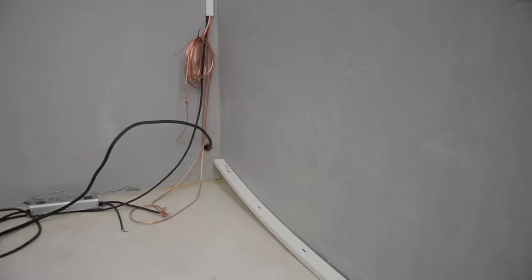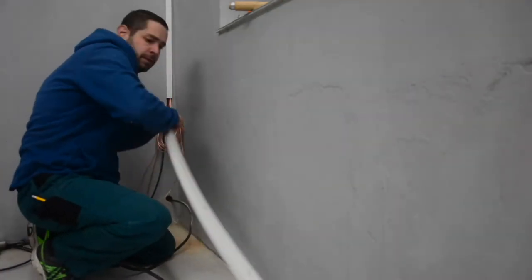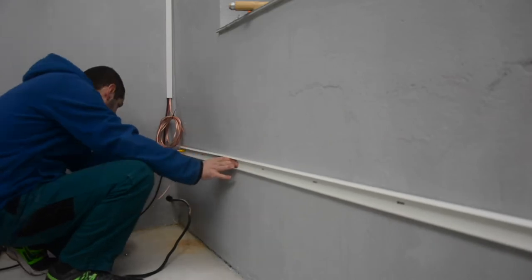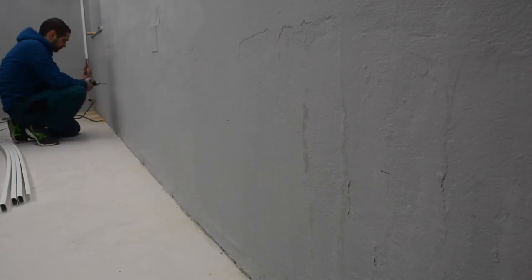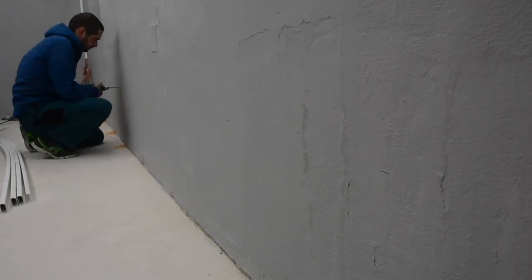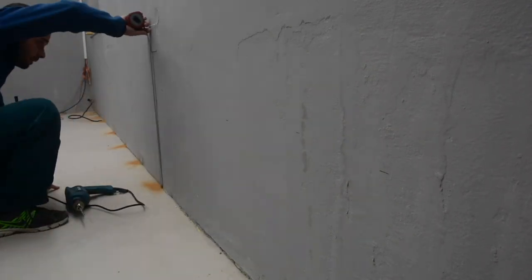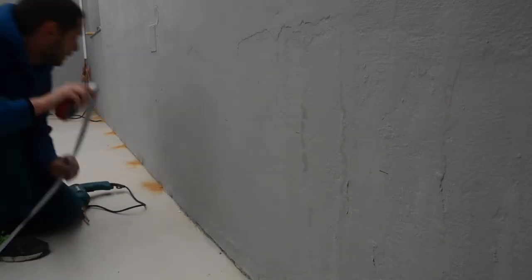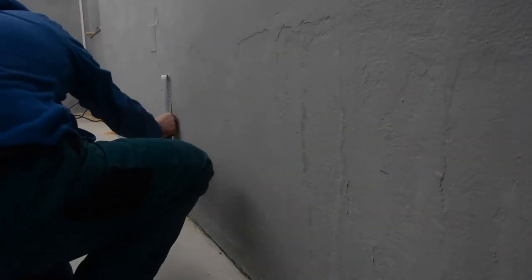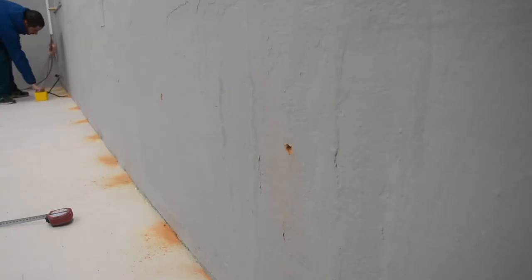Luckily, in the room next to mine there is a good source of 3-phase power, which I will use for my shop as well. I'm pulling a fat 5-wire cable with a cross-section of 4 square millimeters. I will use one phase for powering the lights and other stationary equipment. The other two phases I will use for the power sockets, which will be evenly distributed along two walls under the future workbenches. I'm not sure about the workshop layout yet, so I'm not going to put any power sockets above the non-existing workbenches yet. Once I do a few projects in the shop and learn more about the workflow, I can add power sockets where I see fit.